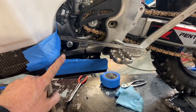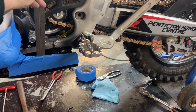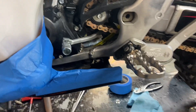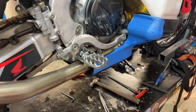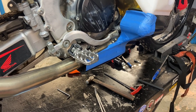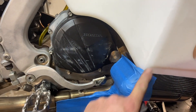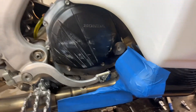What I plan to do is kind of follow this line down and over — I'll take away this ridge. I'm also going to lower this just a little bit, because if you look at it this way, it's about two inches to the bottom of the shifter and my boot is thicker than two inches, so I need some room in there. Going over to the other side, it's the same idea — it's about five-eighths of an inch between the skid plate and the brake pedal, which means you're always going to be braking with just the tip of your foot. I'd rather have a little more room there, so I'm going to follow the tank mold line down and around. I'll put the camera down and show you the end result.